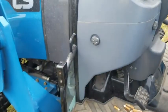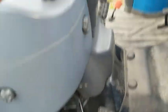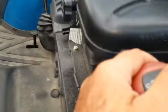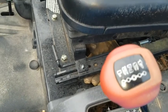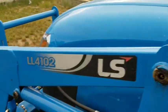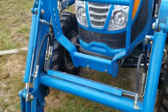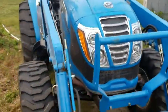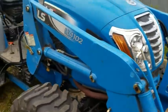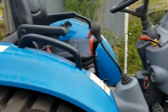I wish I would have got one a little bigger — the next size up, maybe. But the thing about it is, you've got your clutch here, you've got your forward and reverse. You can see all the numbers one through four — when I'm running the bush hog I generally stay in first, number one, low, all because I've got stumps out here. I don't want to have to replace too many blades if possible, or tear up my PTO. It's dirty — it's been working, but that's what it's about. I have no place to put it out of the weather; actually, I need the weather to wash it.